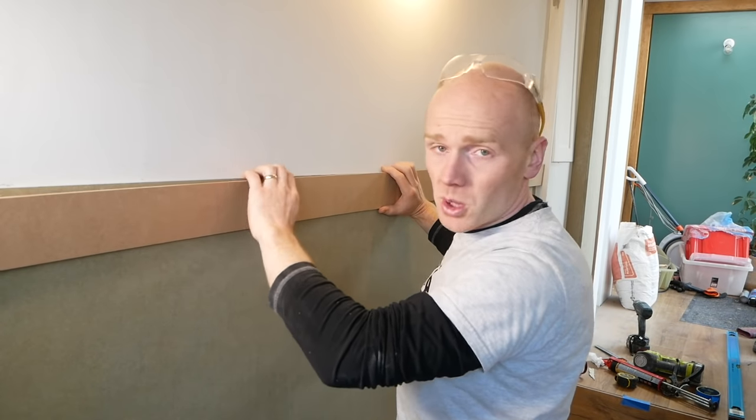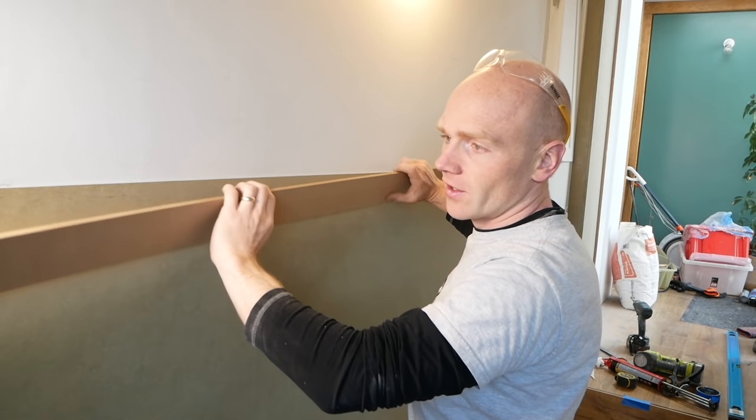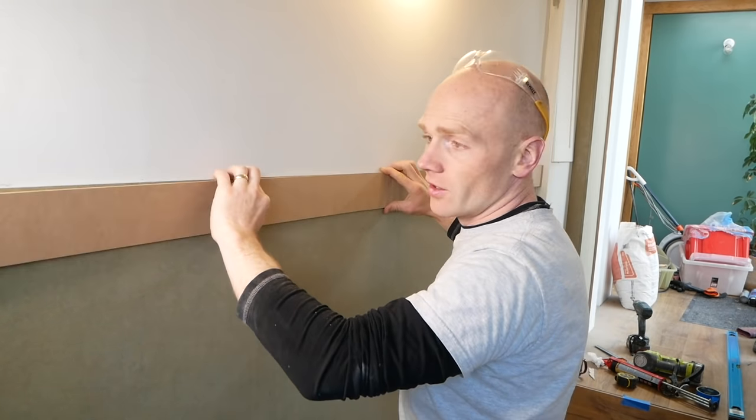And if you haven't got a table saw or a track saw, you can still do it. Like I always say, it's not about finding an excuse, it's about finding a solution. So if you can't do it yourself, then just buy the strip wood. You can buy plain pine strip wood, 4 or 6mm thick, and just buy the width you want. It's going to cost more, but you don't have to have the tools to do it. You can cut down the backboard yourself, or you can just go into a store and get them to cut down strips of MDF on their big panel saw. So I know the top of this is perfectly level. I know the bottom trim is perfectly level, so theoretically all of the verticals should be the same.